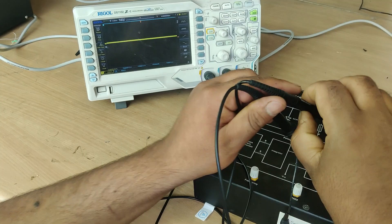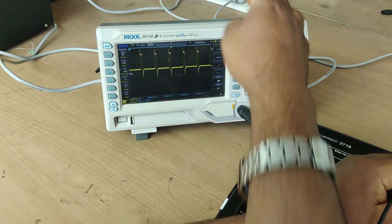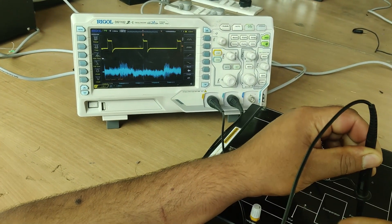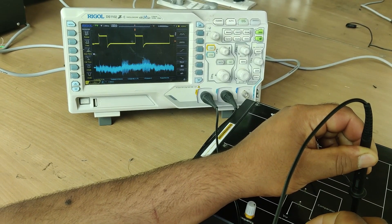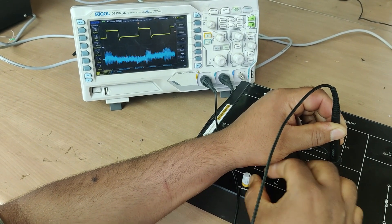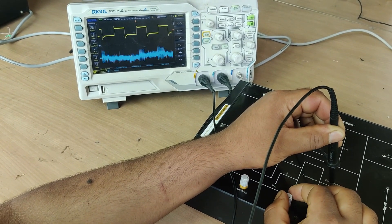The same will be seen by connecting this pulse. You can see my pulse, which I will be feeding to this switching device here. Depending upon the value of PWM, you can see the reference is changing, and accordingly the on-period and off-period of the pulse change. This same pulse will be fed to the switching circuit SCR.